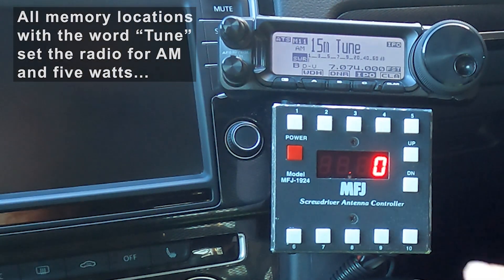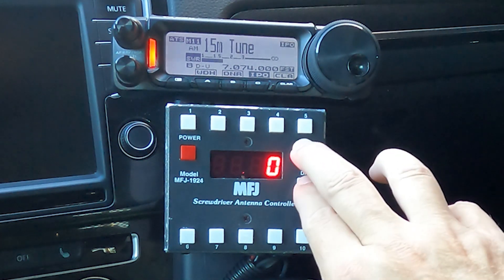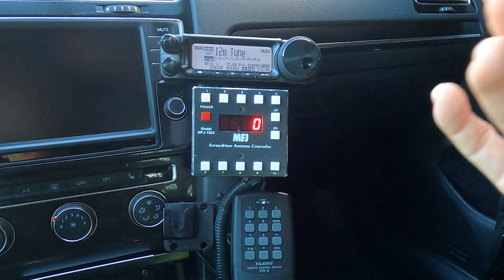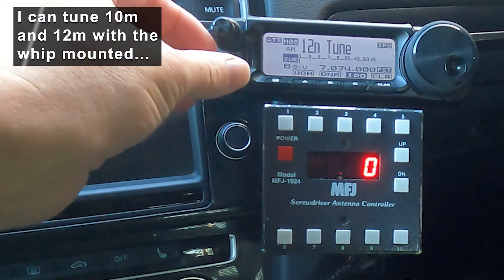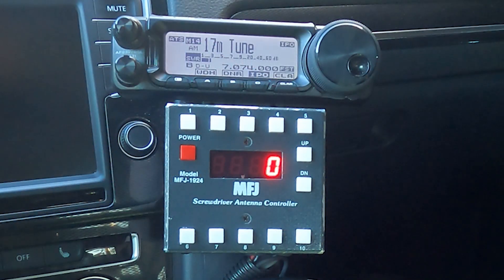Let me show you how easy it is to operate this controller. Since I am tuned for about 15 meters, let me go down to 15 meters to demonstrate. So here I am, 15 meters — that's zero or still position. What I do to fine-tune or check is I key up, KE4WMF, and then I check. The tune is good. Now if I were to try to tune to 12 meters, this antenna can't go low enough to tune that in. And 10 meters is out of the question. But for 17 meters, I press and get the tune at center of my band privilege.